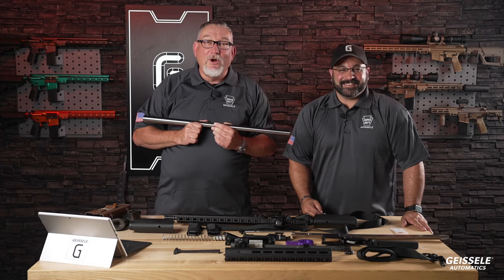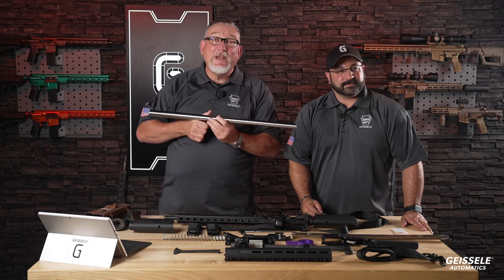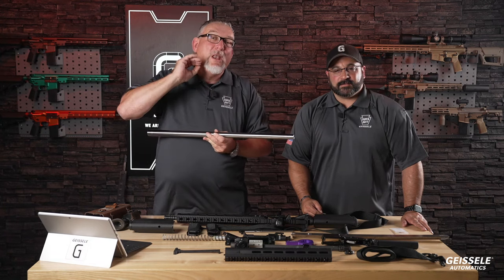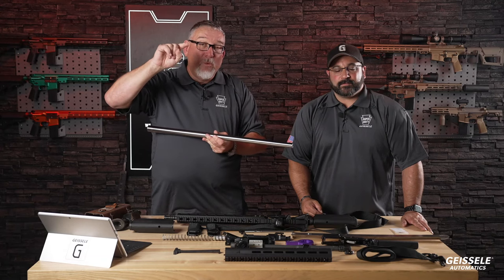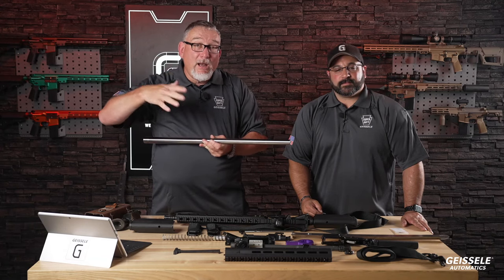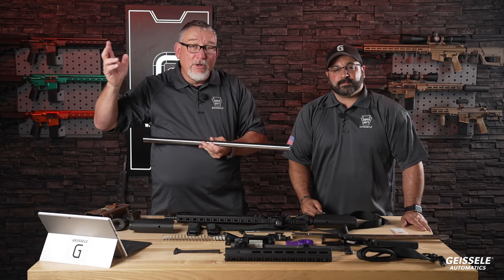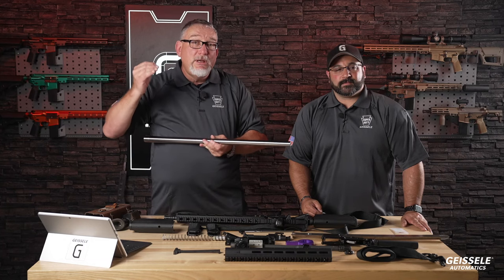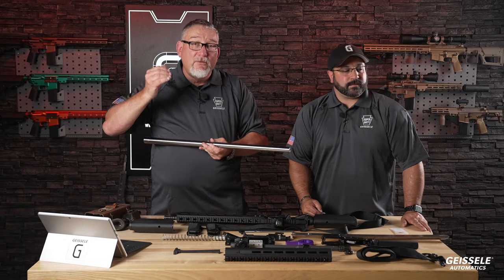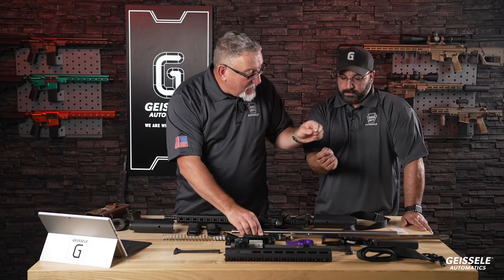All right, so they all have very nice girl names, and they're sitting above the cut riflers, and these are in-house CNC controlled. They're not mechanical. If I want a different rifling twist on it, I just punch it in, and I can make a 1-8. If I want to change the next one to 1.5, it literally takes 10 seconds to do. This is our own tooling. Everything on it is created in-house. I'll show you how the rifling is made.